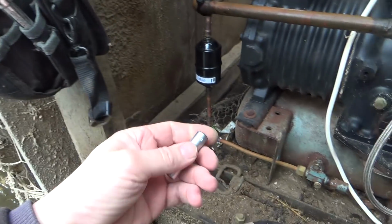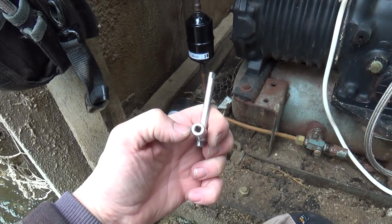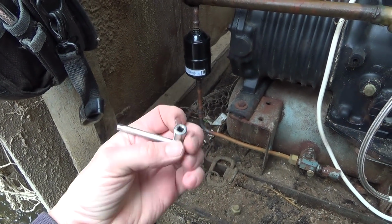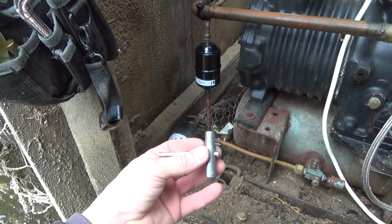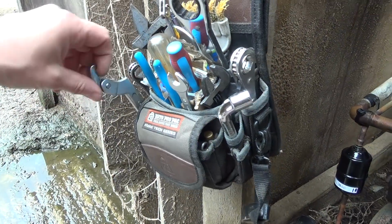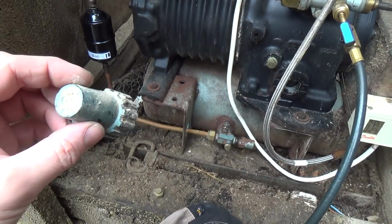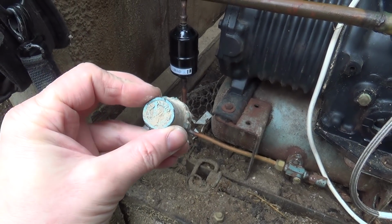a little brittle tool, that's 1/4 inch, that'll fit them valve stems. It's for small expansion valves. You can adjust for that. Really old Frigidaire stuff used to have that size on the receiver. It lives in there. That usually lives in the other tool bag, because I hardly ever use that. There's probably only about 2 places where I've got these plastic caps still in use. Hand tight only, I think it is. Seal hand tight.